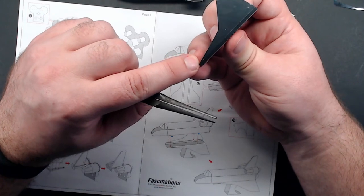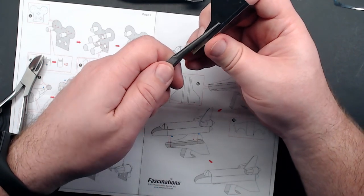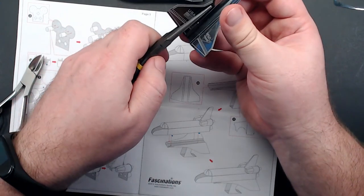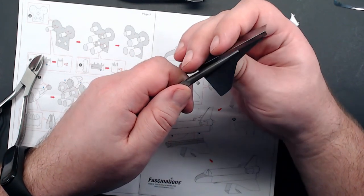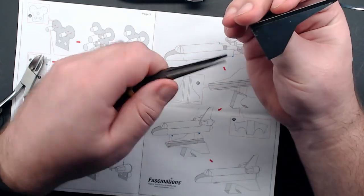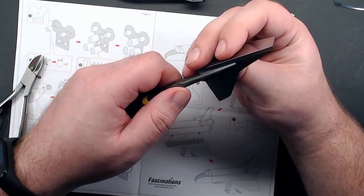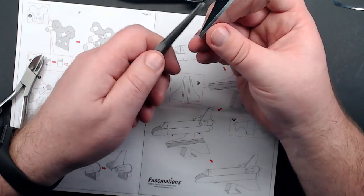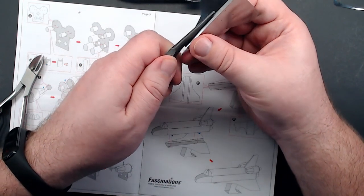This has a nice thin edge right up here at the front, which is very difficult to get folded right. So you want to pinch as close as you can to that dotted line with your needle nose pliers and do just the smallest little fold there. When you have this sort of recurve fold, instead of pushing with the back end, you have to twist with the pliers, because if you push, you're going to alter the other fold you've already worked out. By twisting, I'm pivoting at that point, not pushing against other pieces of metal. I'm just torquing that one piece of metal and trying to get it to go the way I want it to go.